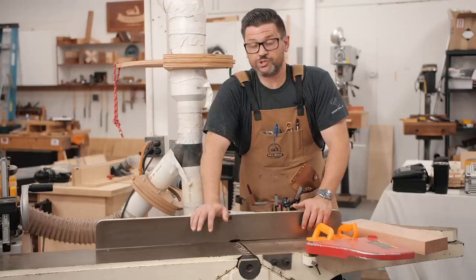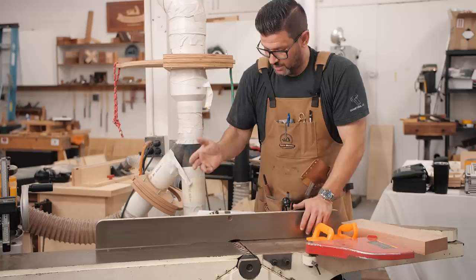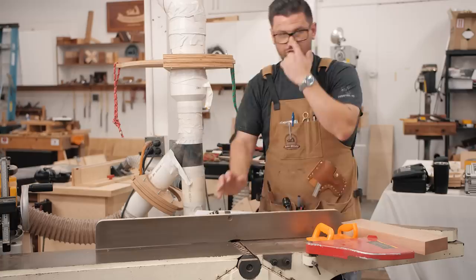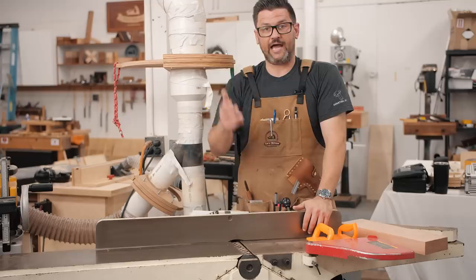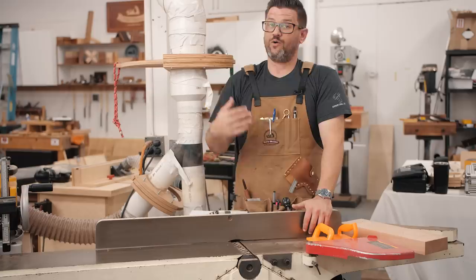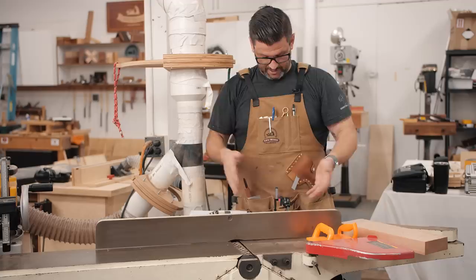So that's about it. Jointers are pretty simple — a machine that needs to be respected, but if you use it safely, it's one of the most useful tools in hardwood lumber projects because it sets the course for the rest of your project being square. A couple of other tips: you want your body to be evenly dispersed between the two tables. Once you get onto the outfeed table, that allows you to keep your weight centered over where you're pushing down, which will keep you safer. Never remove your guard for any reason, unless you are doing a board that is wider than your jointer and need to make use of that rabbiting ledge. It's a great tool to have — typically in the grand scheme of building a wood shop, it's one of the last tools you buy because there are ways to get around it. But once you do get one, you see why they are so useful because it really saves you tons of time in milling. Thanks for watching — if you want to support the channel, head over to the Katz Moses store, pick up one of my new aprons, a dovetail jig, or a stop block. Stay safe in the shop. Have a wonderful day.